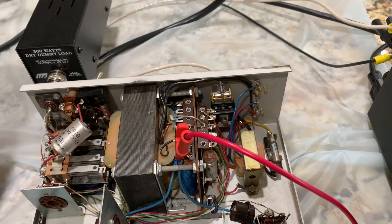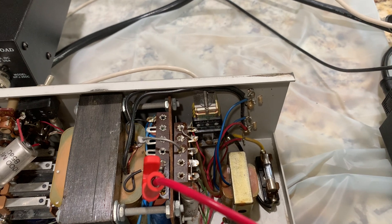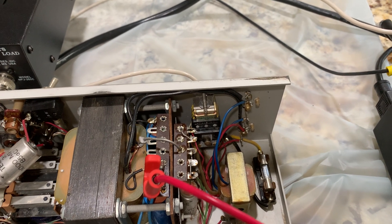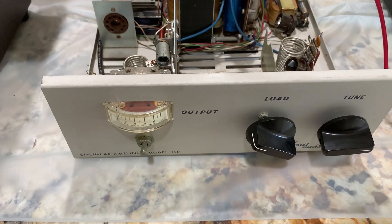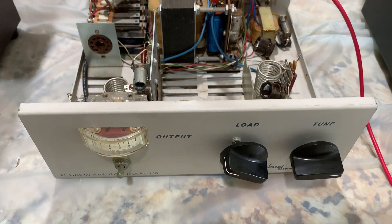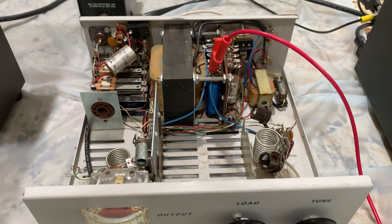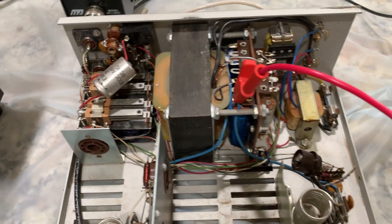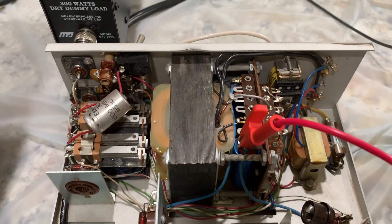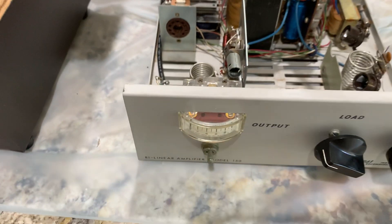So it's going to need a little bit of work. The only problem is, since this is a mobile amp, it has that vibrator on it. That noise is going to get picked up by the D104, so I'm going to have to put this down on the bottom shelf and leave the Dimco mic compressor turned down lower because the mic's going to pick it up. It's only on transmit. It's also going to need a little bit of rework — it's got two big 450-volt caps I have to replace. I haven't checked to see if the receive preamp is working.